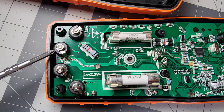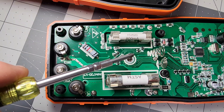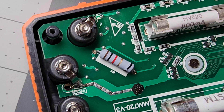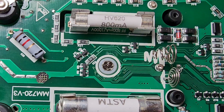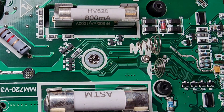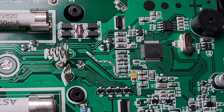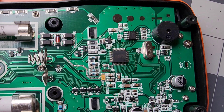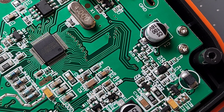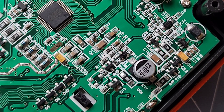There's a nice high-powered resistor on the board, and the input jacks are the screwed-and-threaded type — not cheaply soldered. That is quality, and you're paying for it. Klein's input impedance is 10 megaohms, which limits current flowing into the meter — a good safety measure. The meter also uses double insulation internally, adding an extra layer of electrical isolation: if one layer fails, a second is on standby. This contributes to its Class 2 rating.